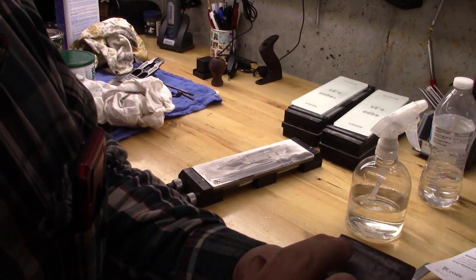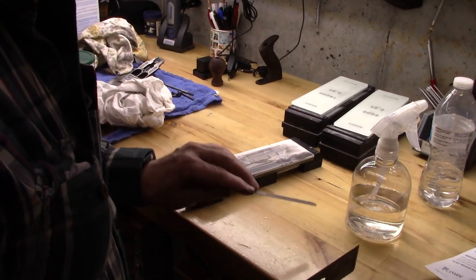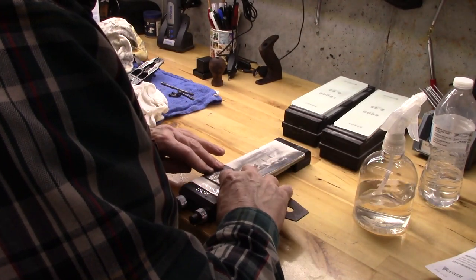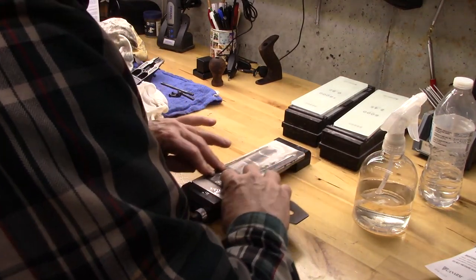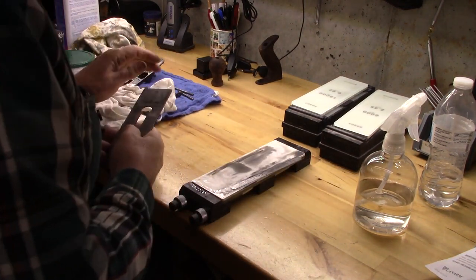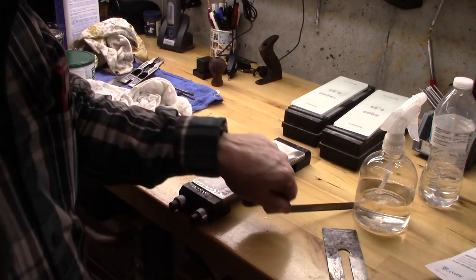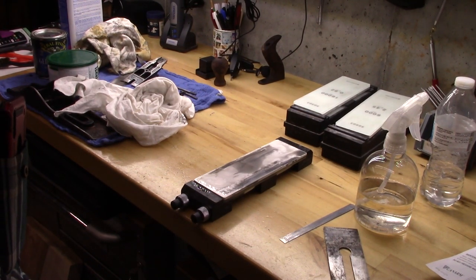Nope, still the same. So you can see we're not sharpening to the edge, so we're going to now go up with this steel rule just to the edge of this and see if we can get just a very fine shiny edge right at the edge. I can see rust coming off. Well, it's starting, so we'll flatten the stone and come back and do this some more. I like to keep the stones extremely flat because they're the most accurate in getting what we're trying to do, namely a really fine edge.